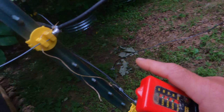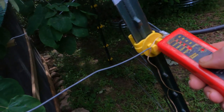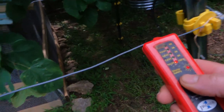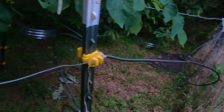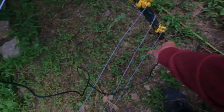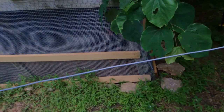I've looked at pretty much everything to see what could be causing this to act up. The no-contact tester — you just walk up to the fence and touch it. The other one you put the probe on the fence and touch the ground with the other end. Neither one is showing anything. That makes me think there's something wrong with the controller. Let's go up and look at some common things that can go wrong with them — you'll generally need some pliers and sandpaper.